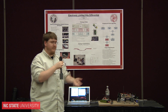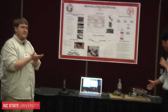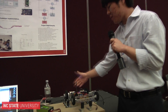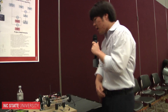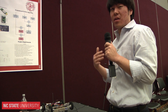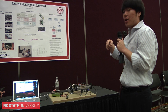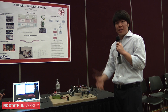For the control algorithm, we took the encoder values for each of the two motors and converted them to RPM so we can get the speed and rotation of each of the wheels. From that, we were able to determine if one wheel was slipping — one wheel had resistance and the other one was free-spinning. We would then take the difference of those two RPM values and convert it back into a digital value, which we would add or subtract, depending on which side was slipping, to the desired user value. From that, we were able to create the effect of a differential.